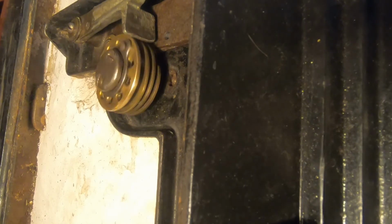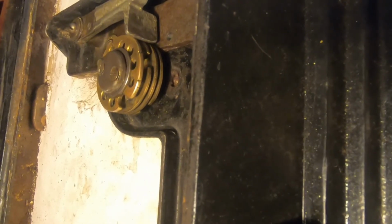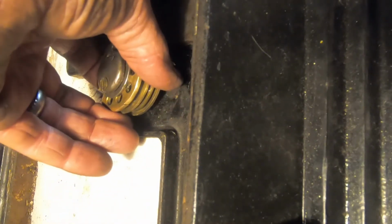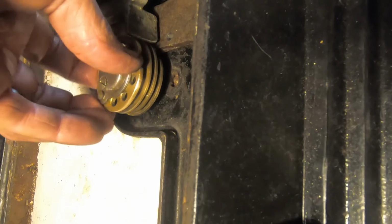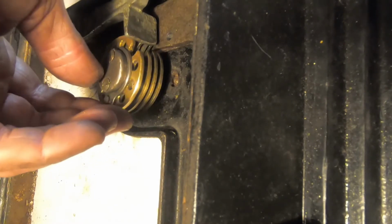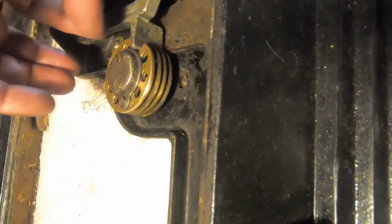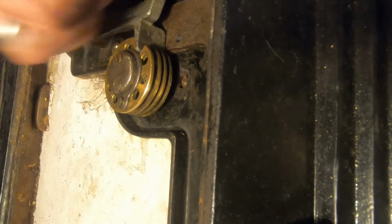So, seemed like it did pretty good. It feels nice and smooth now. There's very little play in the, at least axial play in the dial. So that's nice and clean. The bar seems to be dropping into place really well on its own. We'll line these up again. Find the best spot for that. So, yeah, that drops down, moves freely, drops down into place like it should.